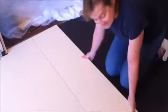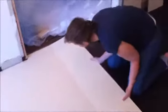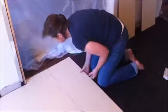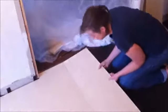As you can see, I fit it and then it comes apart, and I fit it and it comes apart. It doesn't go together nearly as simply as it seems to in the video that Forbo produced. You have to sort of zip it together. What happens is I'll post myself on one end, she'll post herself in the middle. We only have 2 people here, no photographer, sorry. And we get it so that there's no gap. And then I continue working along and I erase this gap by lifting it and fitting it. That's how it goes in.